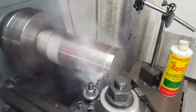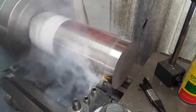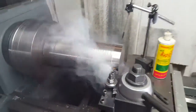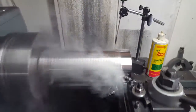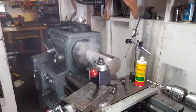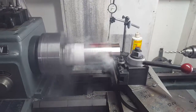We'll make one pass at this diameter, check the progress, and go back and make one more pass to get our final diameter. Then the next operation will start slicing this thing into slices more along the thickness of the flange. That's what we're up to today. Thanks for watching.